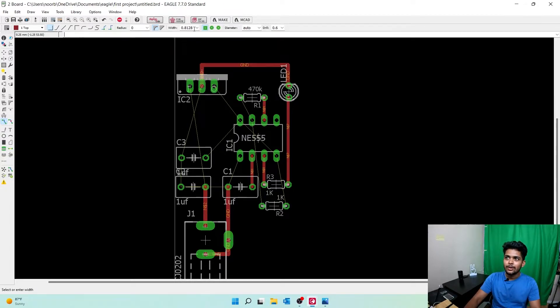Now let's go back to width 0.6 for the smaller connections. Find the easy ones first — don't complicate things. Select this one, bring it over and connect it right here — voila! Now this capacitor can be connected easily. Connect it. There's another wire I'll show you how to do. We can connect this over here, route it like this — good. Now select and place it like this: 5 volts, amazing!